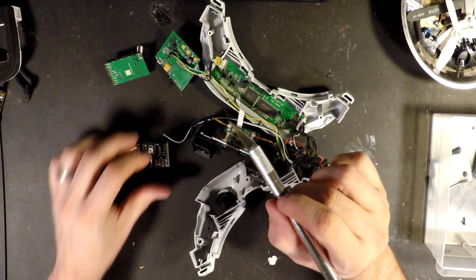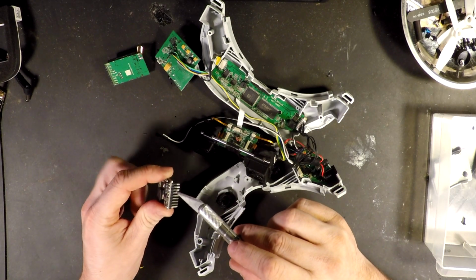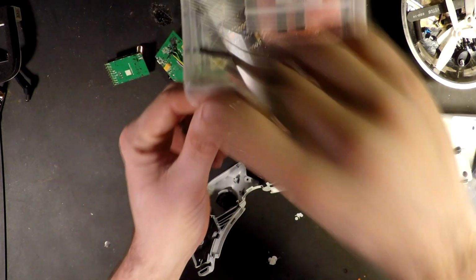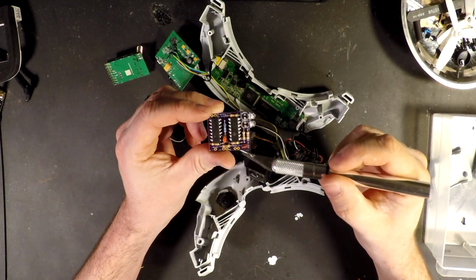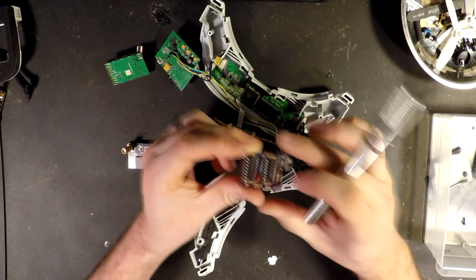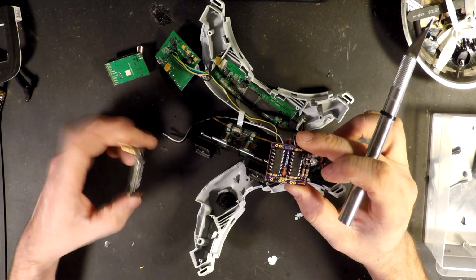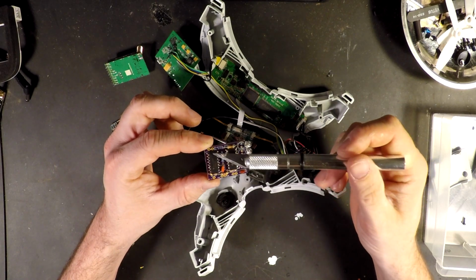So what I will do is I'll have one soldered on the video after I cut the pin off, solder a cable to video, solder a wire to RSSI, and then they are going to come over and it will be RSSI 1 and video 1. So my first primary receiver, everything else is going to plug in as normal except for the video. And the other two wires are going to come over for RSSI 1 and video 1.